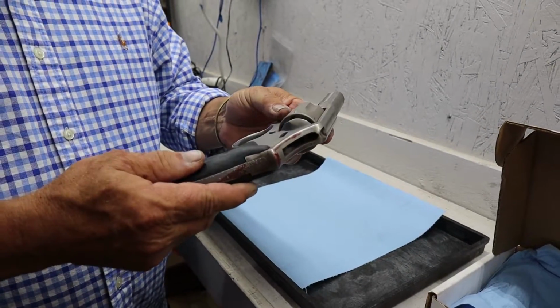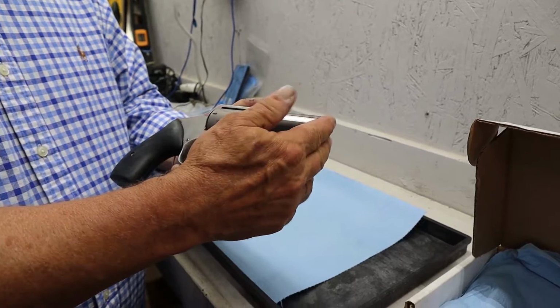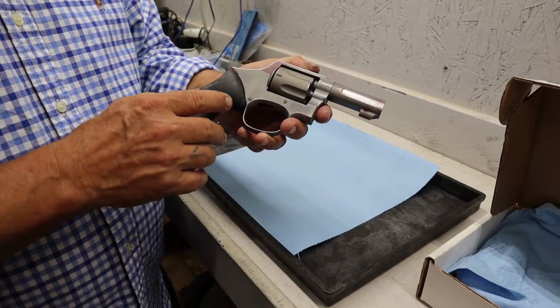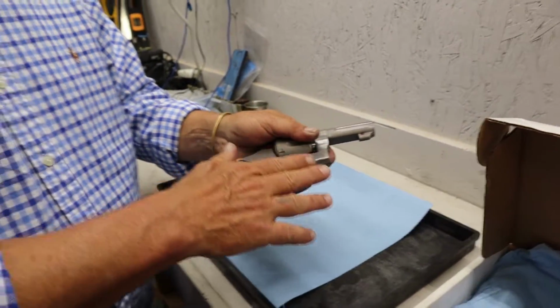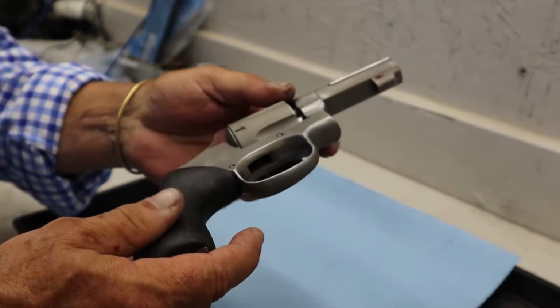This is a chopper that's close to completion. We've got the barrel shortened, milled down the sides of the barrel to remove that lettering, but also it makes it a little bit lighter. You can see that the trigger guard has been narrowed, and then everything has been recontoured so it kind of matches up. Again, that's so you can flow onto that trigger smoothly.